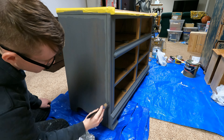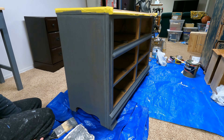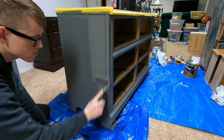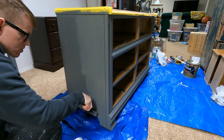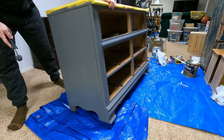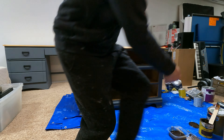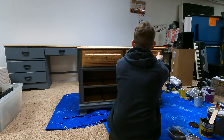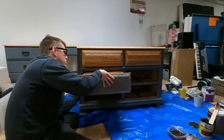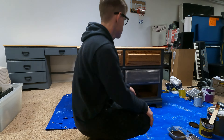In case you've never used Beyond paint before, they want you to take a paintbrush and dab paint in all of the hard-to-reach areas like corners, small details, cracks, crevices, and whatnot. For the bigger areas, they recommend you use a roller. After my two coats of Beyond paint on the dresser and the dresser drawers, and the two coats of stain on top and on the two drawers, I put all of the drawers in the dresser to see how it looked.